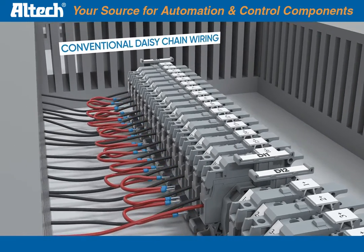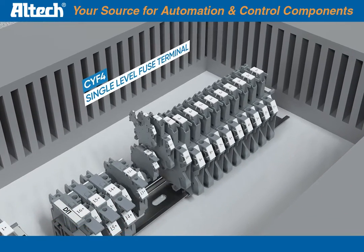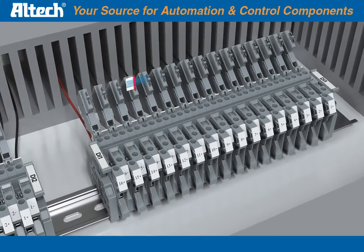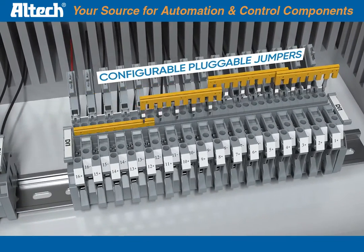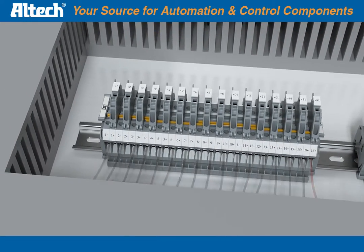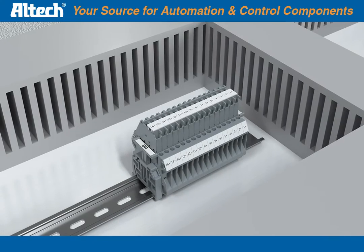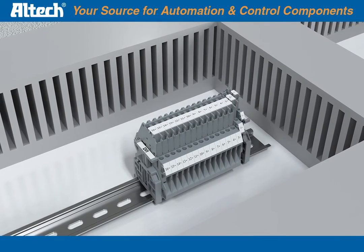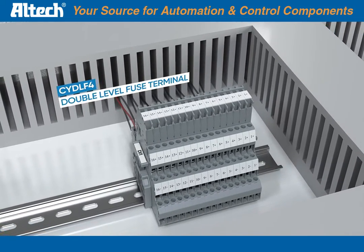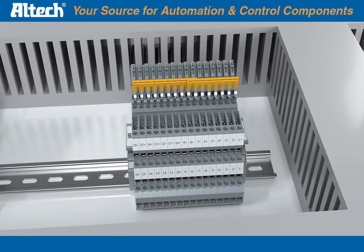Traditionally used unsafe and cluttered daisy chain wiring can be replaced with simple pluggable jumpers in the new CY series fuse and feed through terminals with a 2-channel jumpering feature. For simple 2-wire sensor connections, double-level fuse terminals can be used to replace individual fuse and feed through terminal, saving 50% space on the DIN rail. Smart jumpering is also provided on all levels.